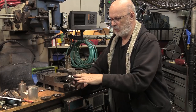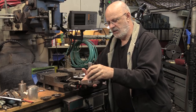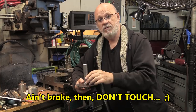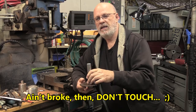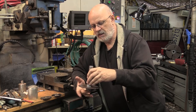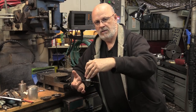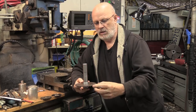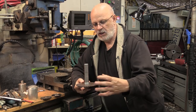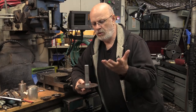Another important thing is the arbor. You're going to have two things to look for when installing a slitting saw. First, when you see the slitting saw turning very regularly, that's good — but why should it turn regularly? The first problem you may encounter is wobble. The saw goes a little bit side to side — I exaggerate — but that's not something you want. It's not going to make regular cuts; it's going to affect the width, the direction, and the precision of the cut. The work is just about useless.